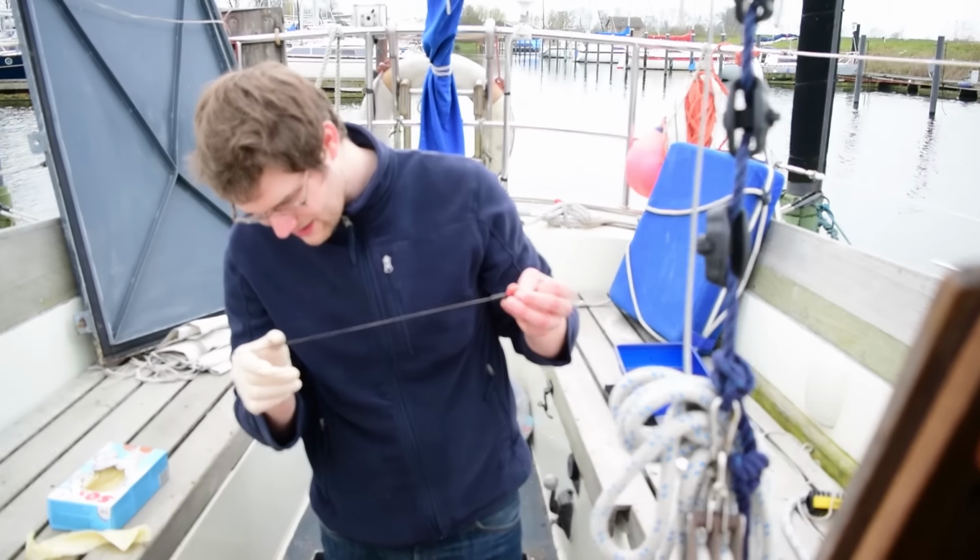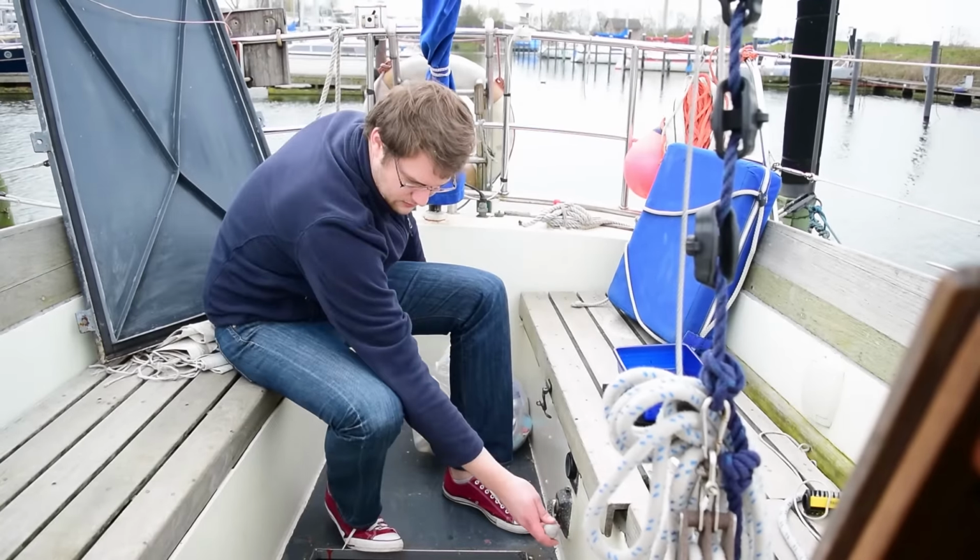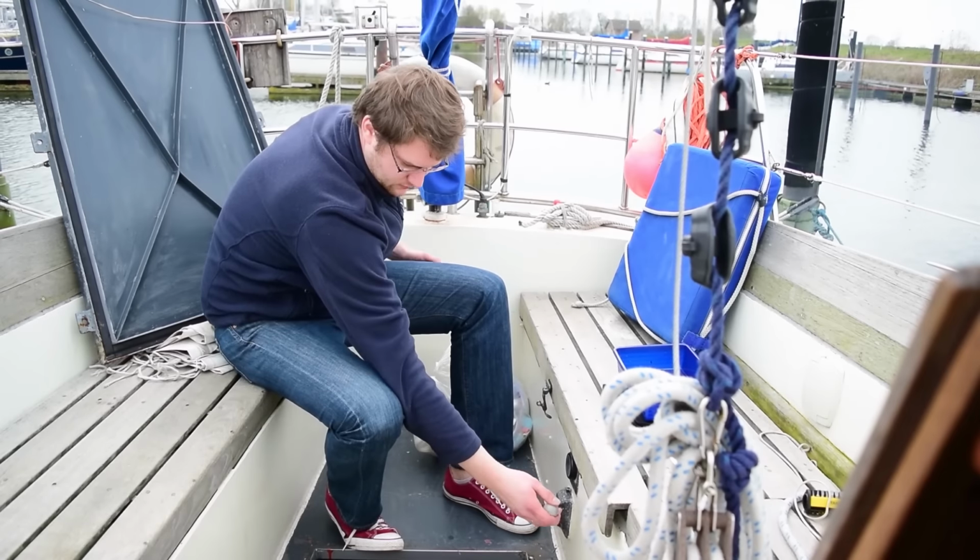Looking forward to that. We de-winterized the engine, but somehow no cooling water is exiting the exhaust hose on the back of the boat. So I'm going to check if the impeller is in working order, which I wanted to do anyway, even if there were no problems. And then I'm going to let the engine run for a bit longer without being scared that anything will explode. And I partially already set up the Wi-Fi on the boat, but I'm missing an electronic converter from 12 volts to 5 volts. So I'm going to get on top of this in the next week.